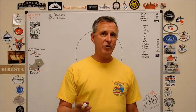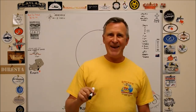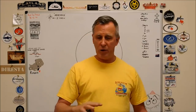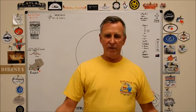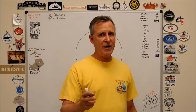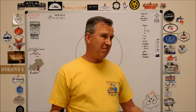I think the optimum choice would be a three-jaw chuck, and there's a reason for this. The only object that will never be out of balance when you place it down on an irregular surface is a three-point object. That's why tripods will always sit still no matter what. You could put it on a rock, you could put it on a shelf, you could put it on a flat, you could put it on anything. A three-point object will always be stable. Now, this being said, three points of contact in a chuck configuration will always hold whatever it is you're holding. Is it optimum? I don't know.